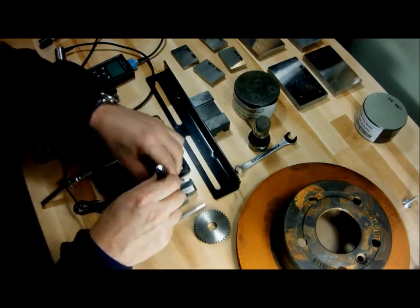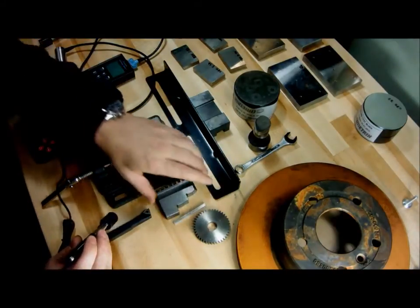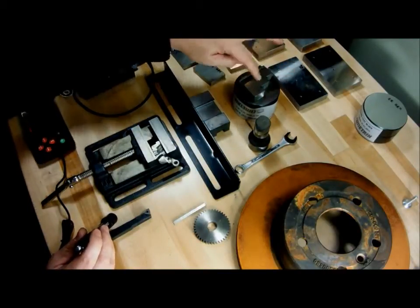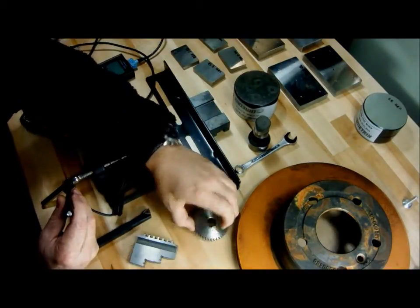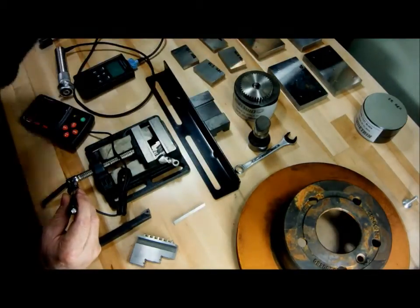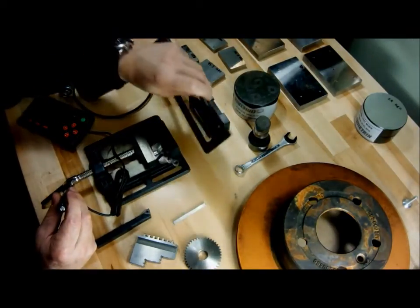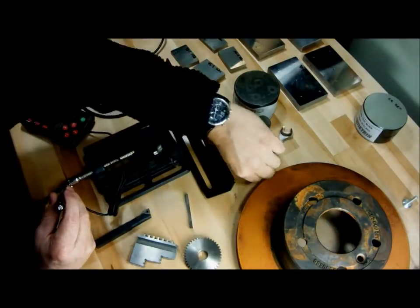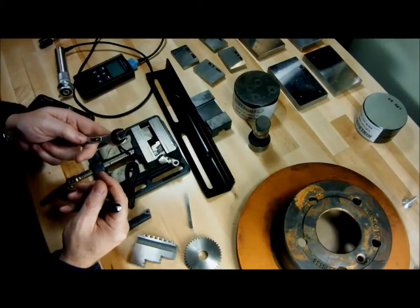Here, if I just test off this part I would get a reasonable kind of reading, but it would be really better if this was supported and neatly faced to another part which was heavier — then doing a test would give a much more accurate reading. A part like this is really getting way too thin, so even sitting on here if it was well supported would not give us an accurate reading. Parts as thin as this — forget about it. And say we wanted to test the hardness of the face of this — no good, it would never be able to measure it accurately.